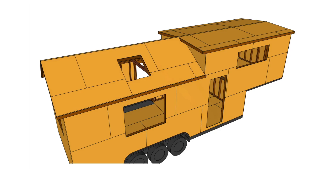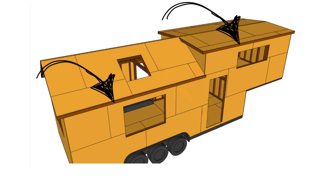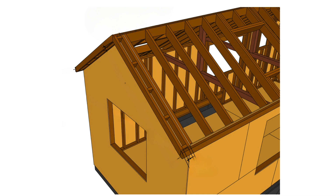When you think about roofing, you always want to layer the roofing materials so that water sheds away from the house. The siding goes all the way up to the eaves and then the eave protrudes just a little bit. On the front and back of the house there's just a two-by-four that went across it. But on the sides, the gables, we made those six-inch eaves that stick out a bit.